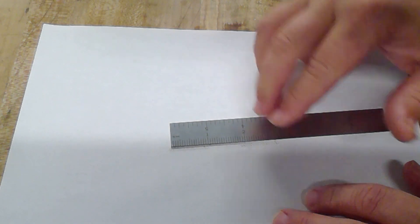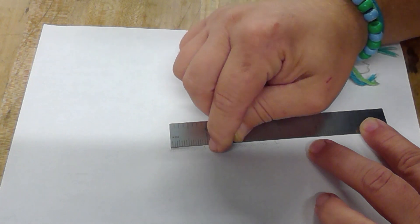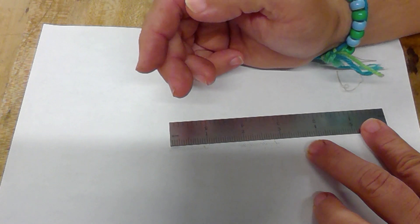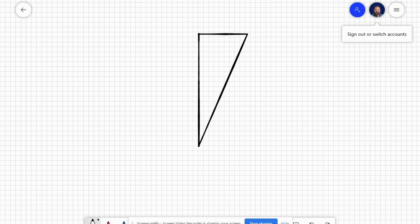If you look down here, if I measure off an inch of this right here and start counting these, I've got 20 lines per inch. That's a piece of information I'm going to need in just a minute. That piece of information is going to allow me to determine how many different leads I need. Because what I'm going to do is use a threading tool to cut a very coarse thread with multiple leads. By cutting that very coarse thread with multiple leads, I should be able to get a piece that has an adequately sufficient knurl for most situations. I mentioned needing to know that angle — I need to know that angle because I need to be able to calculate the lead for my helix for my knurl pattern.